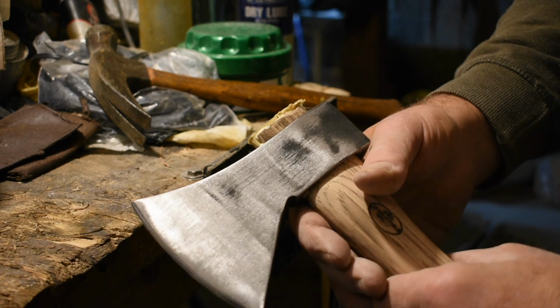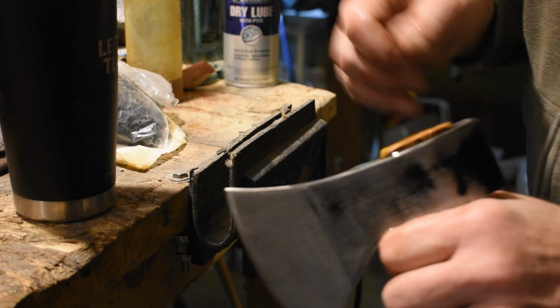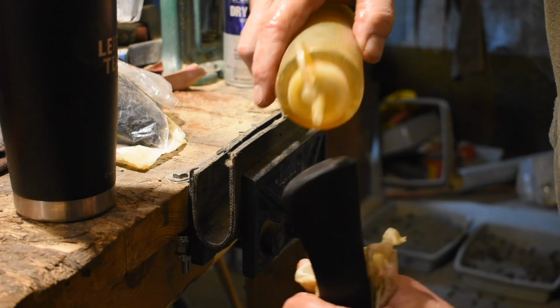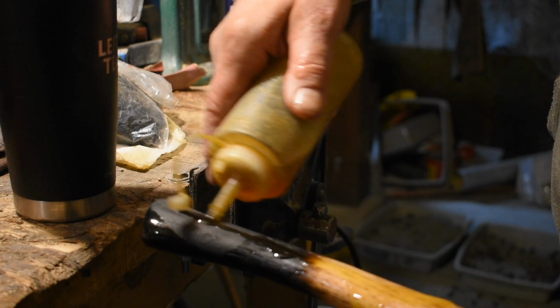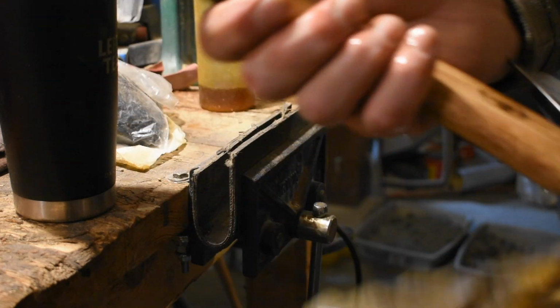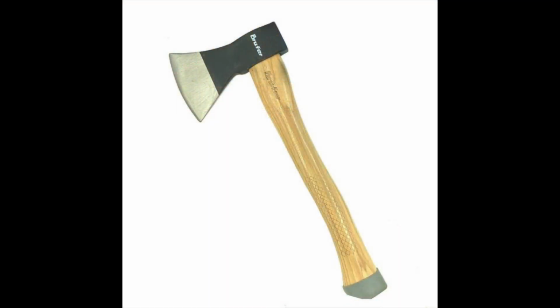And then it's starting to look really good. I got the wedge in. I use glue. That's a debate right there. Don't need to, but I just kind of like the idea of an integrated tenon instead of a three-piece. Then go ahead while it's still warm. Put the boiled linseed oil on, and it's coming out good. It gets 6 or 7 coats of that.